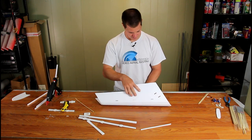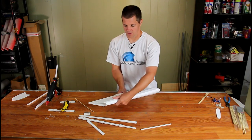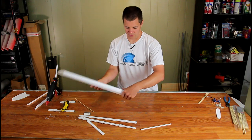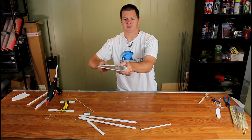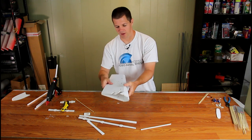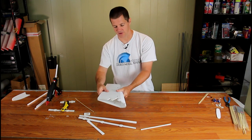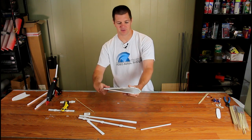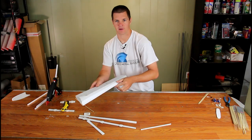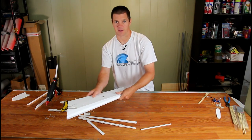Once that's done, bring the panel over and press it together all the way down its edge, making sure it forms a somewhat symmetrical wing. Obviously it's not possible to get it perfect with foam board — not hot-wire-cut EPP or injection molded — but this is basically what you're doing. Be careful not to push too hard and tear the edge, but fatigue it to make it flexible.